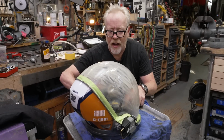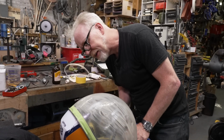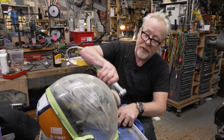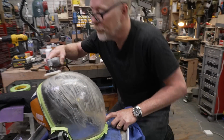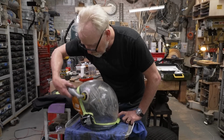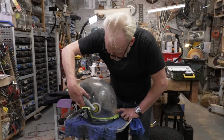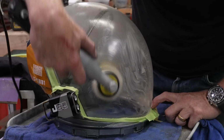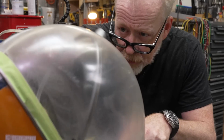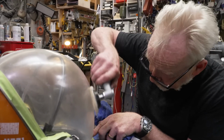So one of the things that I always remind myself about polishing is what is doing the polishing. It's not your elbow grease. Well, I mean, it's partly your elbow grease, but really, polishing compound is simply a fine grit of something in a carrier medium. Toothpaste is a polishing compound. Toothpaste actually has a grit to it. You are literally polishing your teeth. And so it's about working smart, not hard, right? Like letting the compound itself do the work. I'm not pushing very hard. And after a couple passes, I got really good results on the Nagra. So I'm just going to follow the same formula on this guy. I can see I'm not going to get everything off of this at all, but it might make a reasonable dent in its beat upness.